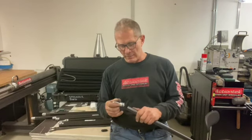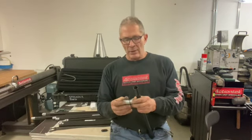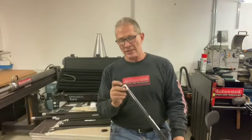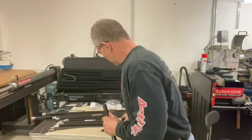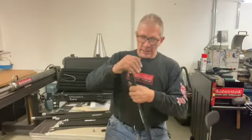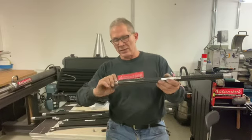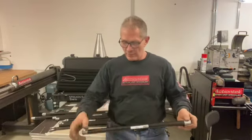These are mic'd to fit this tubing — the tubing is pretty precision. The O-rings allow a tight fit and take the slop out, and you push them in. Since it's a tapered hole, there's a dot on the end that tells you which side goes down, because you want the bar sitting down on the plugs. You put them in and orient the bar — this is the 500, we're going to pull against it, dot is down, both bars are up.